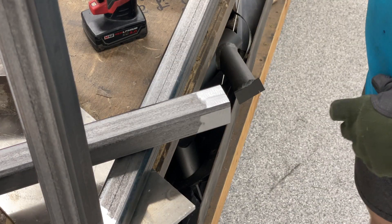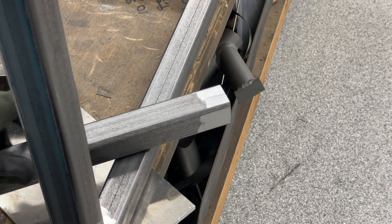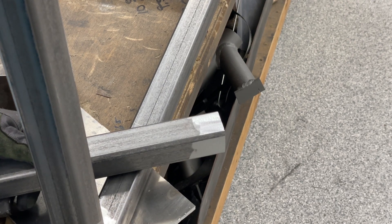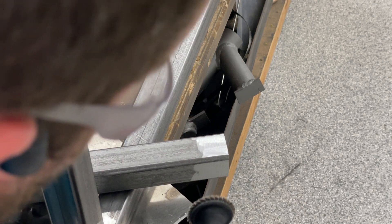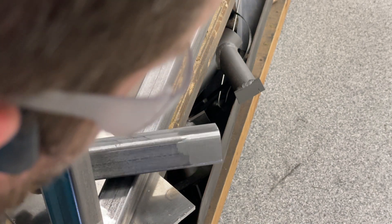Let me walk you through the process. This is kind of a continuous work. You're going to have the part held in place and then you're going to spin it around with your hand like this. Get in a good position where you can stand and be comfortable. Your goal is to go through this as gently and as fast as possible — you just want to get off the mill scale. You don't want to take away any wall thickness. Barely using any force; I am just trying to slick off that scale and that's it.